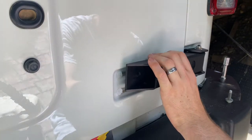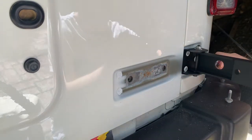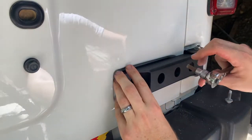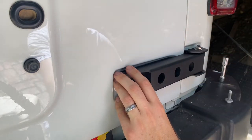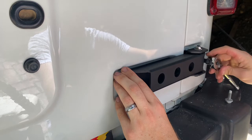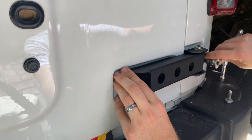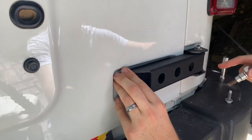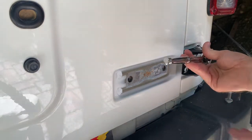That was sitting too high. As you saw there, we'd done those bolts up too tight and it wasn't quite lined up properly, so it was sitting up awkwardly. The trick is to loosely line up these two inner bolts first, get everything lined up, then tighten the outer one down tight so that section doesn't move, and then with everything lined up, tighten the inner ones up.